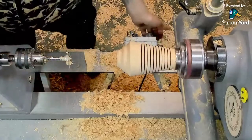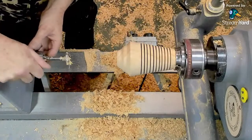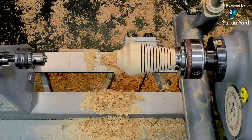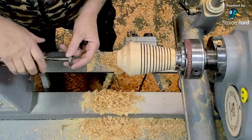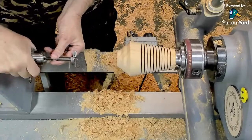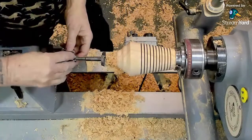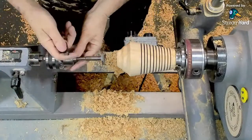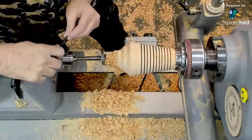Try that then. Put the 40 mil bit in down to here because I want to have a 40 mil seat for the lid, and I'll come back to that 35 in a second. The width of this chuck here is just under 40 mil, or just under 38 mil, sorry. So we'll go in there, if I can get that tightened up.